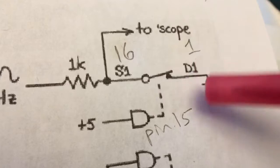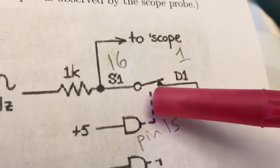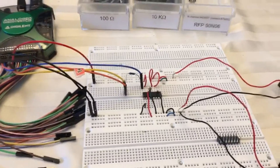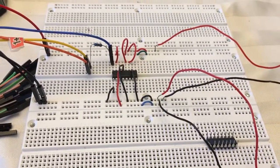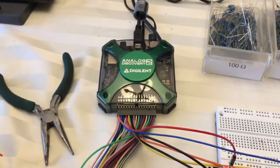That means that this analog switch, when it is in the on position, a perfect switch would have a 0 ohm resistance. This switch actually has something like a 31 ohm resistance when it's in the on mode. So I don't know, that was kind of cool. That was straightforward to do this way. I'm actually going to pause. I'll come back in part 2 of this little video and see if I can make it work without the 9-volt batteries, just for fun, using the plus and minus 5 of the Analog Discovery device.